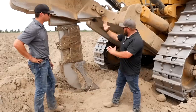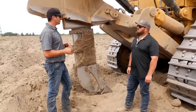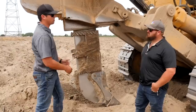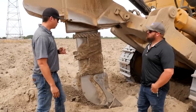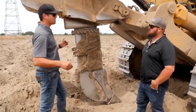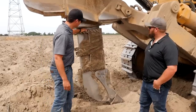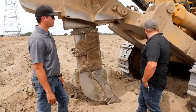When you're ripping through the ground, it all depends on how you start. If you have hard pan down to five feet, you'll start with the shank farther back to get that ripper point down and start breaking through. As you move forward and lower the shank, you bring it to the working angle and rip through the hard pan. These tractors are primarily used for ripping rock and pushing dirt. When ripping rock the shank only sits down shallowly, but when ripping six feet deep you have to make sure you get into that hard pan. If the hard pan is five feet down, you can actually pick the whole back of the machine up if you're not ripping correctly — so you want to ride that dirt level and get the best penetration for what the farmer's paying for.